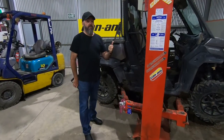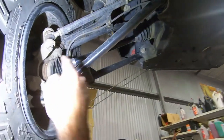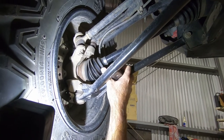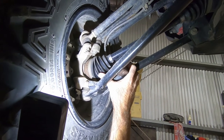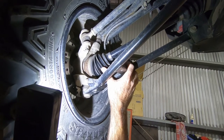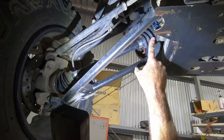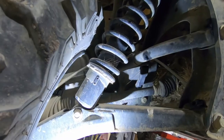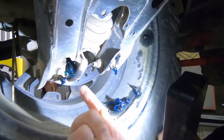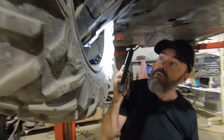We're going to get back underneath the machine to check the CV boots and all of the linkages and grease nipples. These are your CV shafts, these are your CV joints, and these rubber boots are the CV boots. Check those — you may need to clean off mud first. If you get a split in one of those and moisture gets in and grease comes out, you'll get a clicking noise, which means replacement. Each CV shaft has a boot at either end, both front and rear, so keep your eye on them. Under here all of the linkages have grease nipples, so anywhere there are moving parts, give those grease nipples plenty of grease.